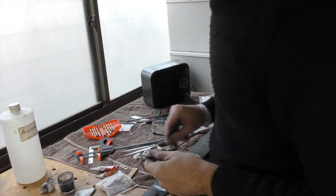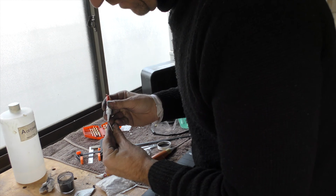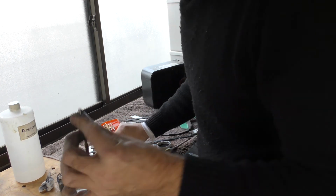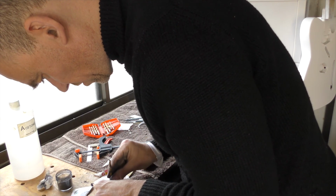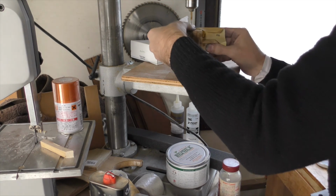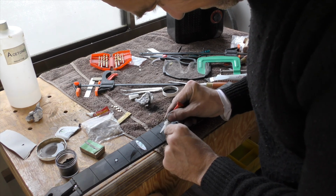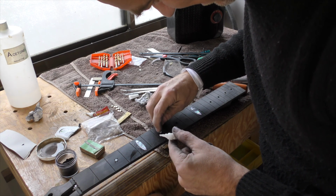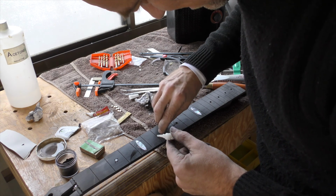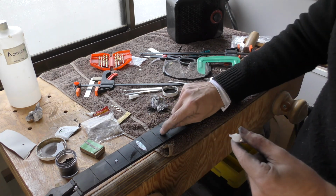Now, making the dots fit is a simple, although slightly annoying process. The dots are 5mm and they need to be 4.8mm. So what I do is I take a 4.8mm drill and I stick a dot on the end of it with super glue. Let's check it out. Some glue. Go. Our dot. Perfect fit.